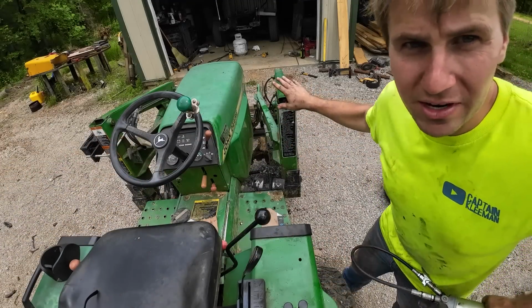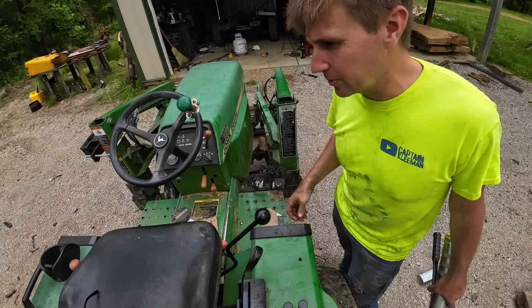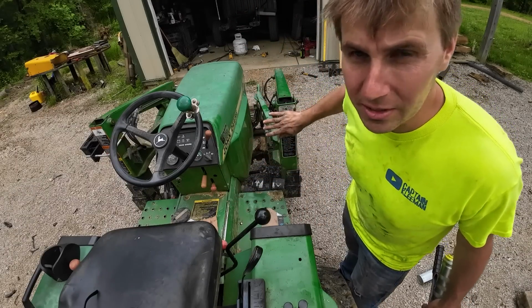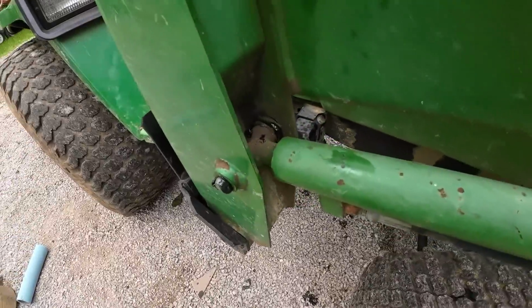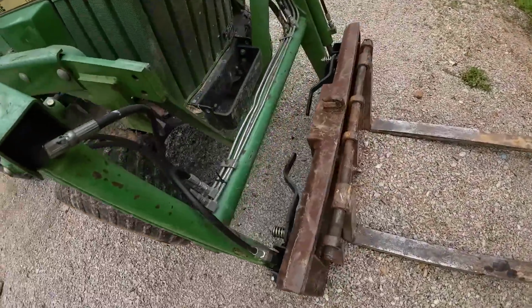It's pretty cool. And if you ever get any fittings that don't take, just wiggle around a little bit, put some pressure on the pins a couple different ways. Change angle of the dangle, you can normally get them all to take. And they did all take, which is good. That one over there was the most stubborn one, but all of them took grease.